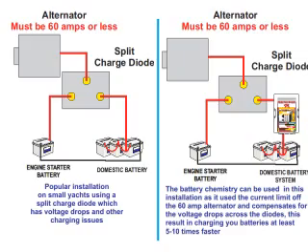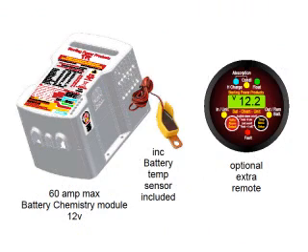The advantages of this product: it's easy to install, fits our product and most competitors' multiple output chargers, and is available in various formats — 12 to 12V, 12 to 24V, 24 to 24V, and 24 to 12V models. There are eight selectable independent battery chemistries to choose from, including lithium and a desulfation cycle. The unit also includes a waterproof battery temperature sensor for battery temperature compensation and high battery temperature trip, plus the ability to add a remote control and remote sense compensation. Six LEDs project over 20 individual charge and warning information events.